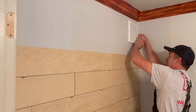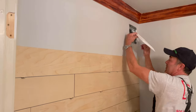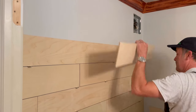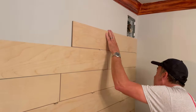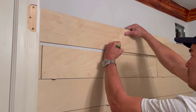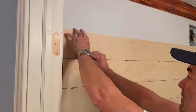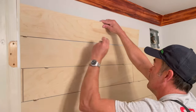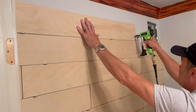More than likely you're going to run into some type of obstruction — it could be an outlet, a light switch, and in this case it's a bathroom vent fan. I removed the grill, held it up to mark my U-cut-out at the bottom, and it actually cleared perfectly — I was in shock — so I just went ahead and put the piece up. If it hadn't cleared perfectly I would have made two marks on each side, noted how far I needed to cut down, and used a jigsaw to cut the U-shape out. Then I finish out that row with a small piece, using my nickels for spacing.